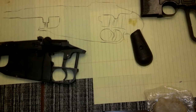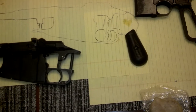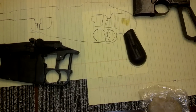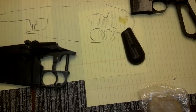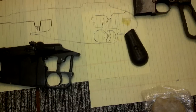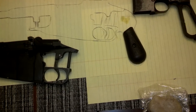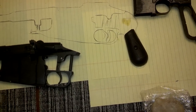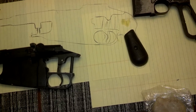I've had a couple of goes at making wax versions of the frame, just because I think that the complex curves involved are going to be a little much for machining on the equipment I have available to me. So if I don't want to get stuck with a tremendous amount of handwork, the easiest way is to make a wax version and then do a lost wax casting, and then mill the flats that need to be flat and do some handwork on the curves — maybe with a belt sander, maybe with just some files.